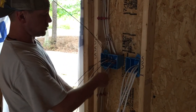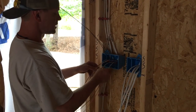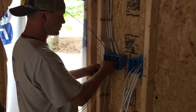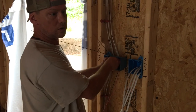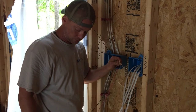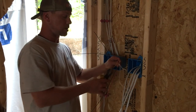You want it accessible when you go to finish packing everything back. Second thing, you want to get your neutrals together — all the neutrals. New code states that all switches have to have a neutral in each box.